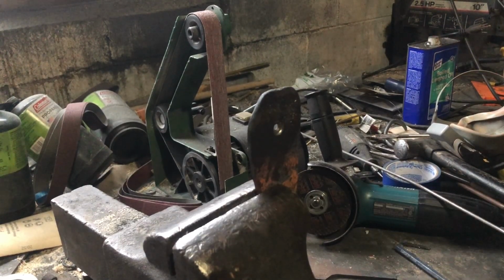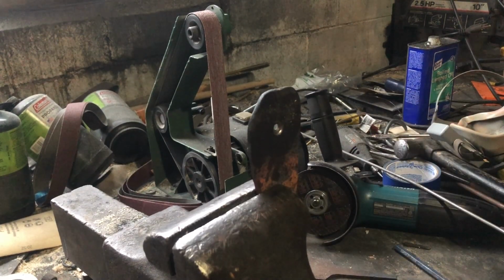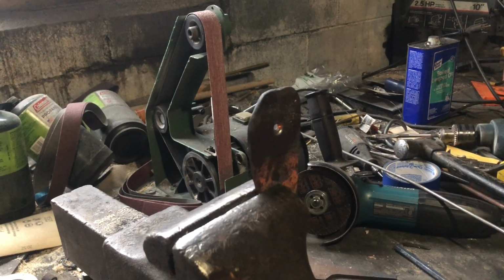Now what I'm gonna do is take my angle grinder and cut it square, and then file it and sand it and stuff to get it to where it fits. And this will kind of be my top cap. Since the last ones I've done were round, all I do is drill a hole, but this one's square because I had to be complicated.